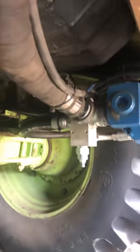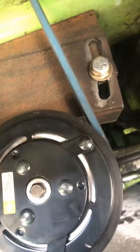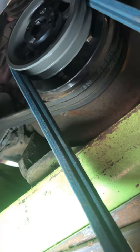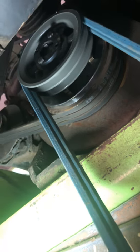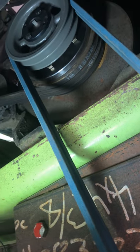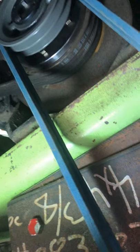Let's have a look here — there's that suction line coming through there, and this line beside it here, this is case drain — that's that half-inch case drain line. So this runs around the back of the pump. The pump is belt driven off of that hub we built to go right on the crank there, and that was all spun up in a lathe. It flies straight and true, it's pretty well balanced, and you can see the big dampener back in there.